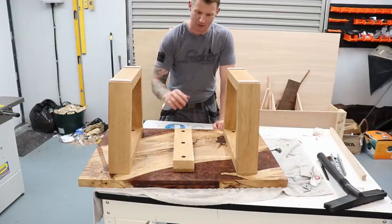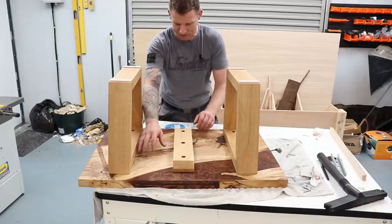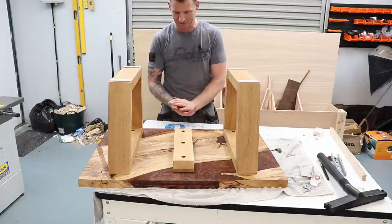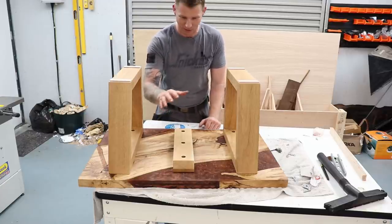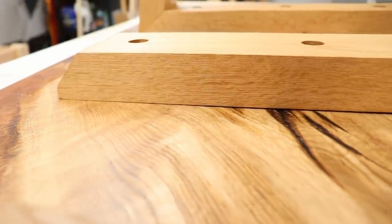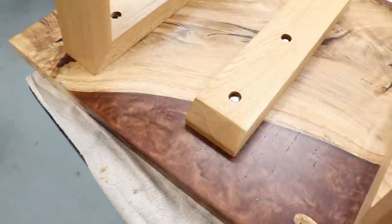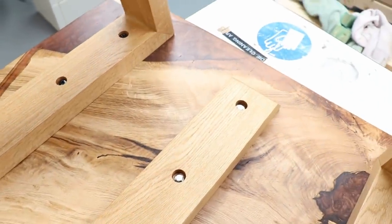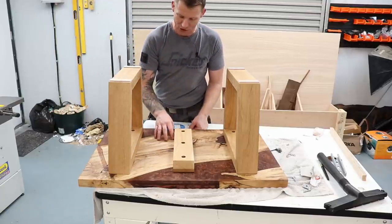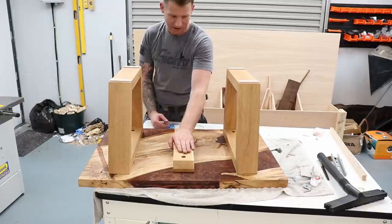I was about to polish the top when I noticed it was starting to cup slightly again — right along the section where all the rot is. There's not much actual timber there; it's mostly filled with resin, so it's the part that moves the most. I decided to put in the center piece using the board I messed up the angles on. I routed another piece of unistrut into it, and between the unistrut and the oak, by screwing the center bolt in I was able to pull the oak back flat. It's now supporting the table and it's good and solid. A surface fix since there's not enough timber to route into from below.